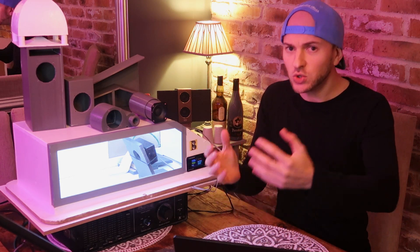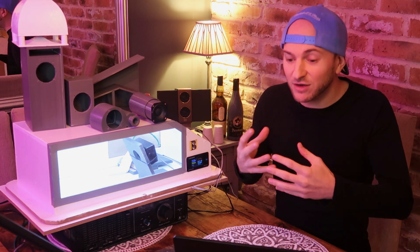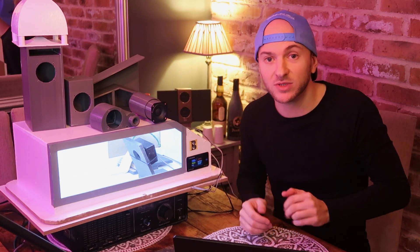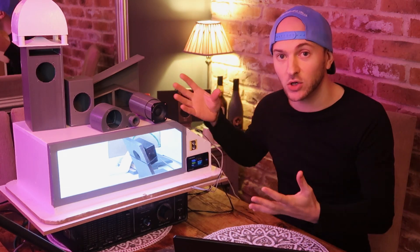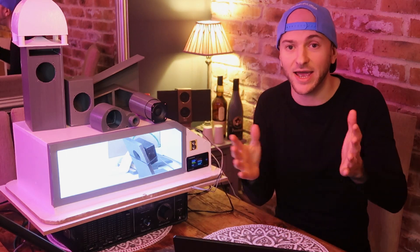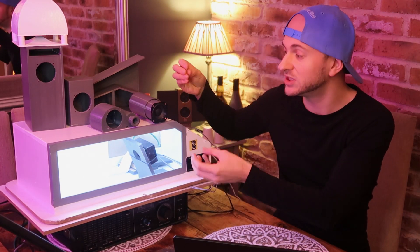My explanation for this is that most of these enclosures have been tuned pretty low, so their port emphasis and dB boost are at the lower frequencies. So especially with 45 and 60 scaled hertz, they're not really being influenced much by the ports. They're all very similar output levels — we're just listening to the radiation from the cone of the driver rather than any kind of Helmholtz or port or quarter-wave boost. The cabin will boost and emphasize lower frequencies if they are produced potently by the enclosure, which is why we've seen 145 dBs on some enclosures tuned properly down there.